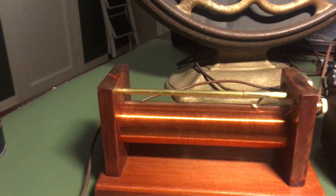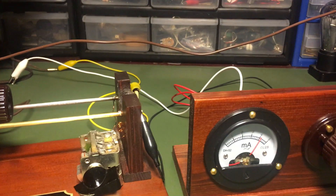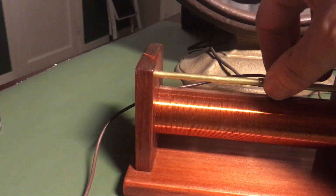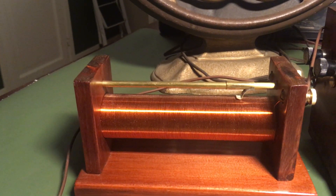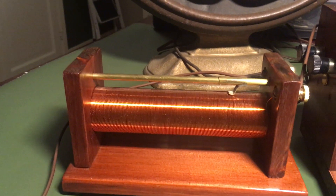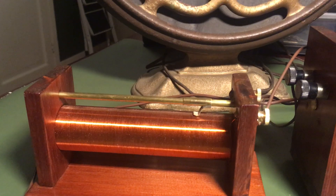This is the antenna tuner used to match the receiver to the signal. You can see the signal went down a little bit because I out-tuned it. Now putting it back where it belongs — trying to do this with one hand. That's about 175 winds and about an inch and a quarter of bicycle pump tube, believe it or not. It's 270 microhenries and it goes down to 0.002 microhenries.